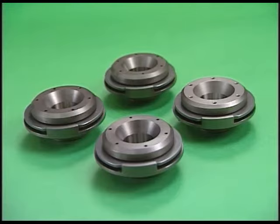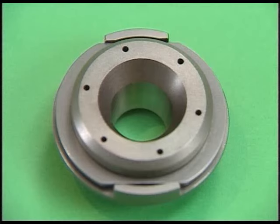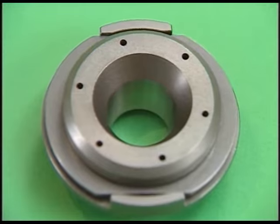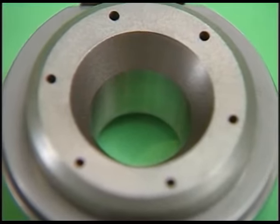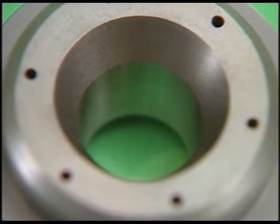Improper rotation of the valve rotator will cause carbon to get caught in the valve seat and blow by at the seat, and it also affects the service life of the valve and valve seat. Therefore, periodically overhaul and check the valve rotator. Here's how to do it.